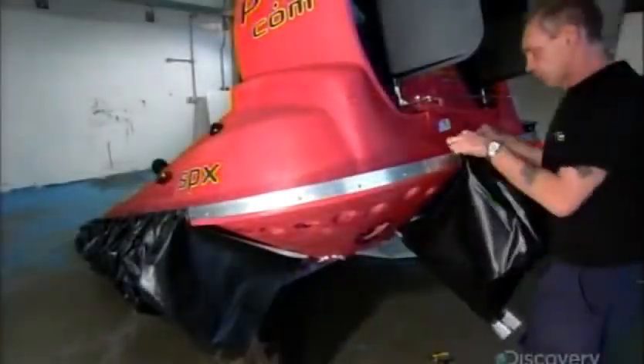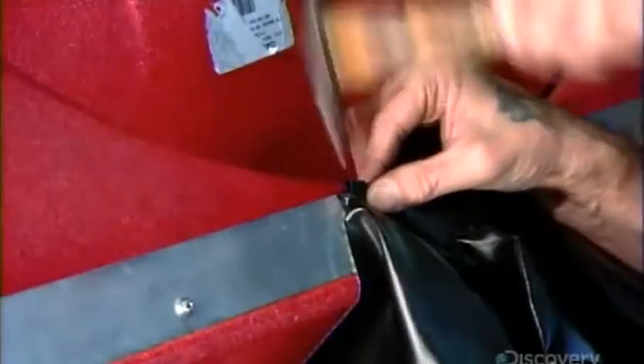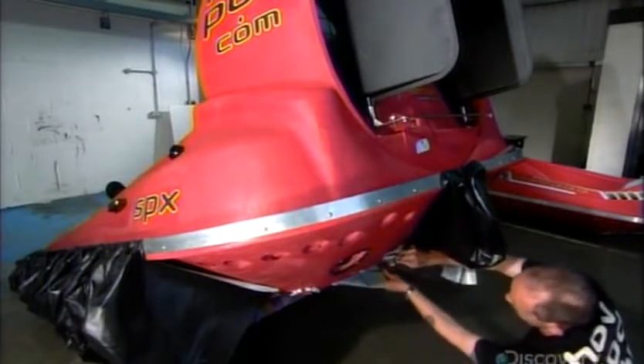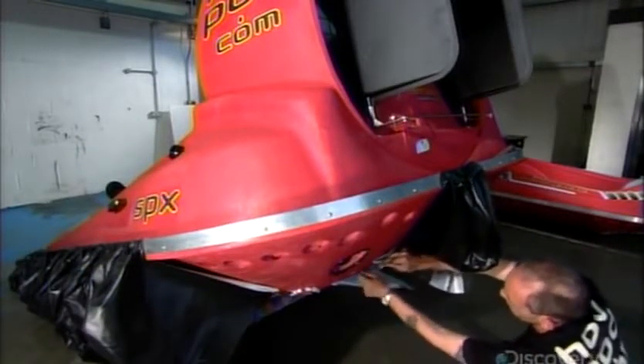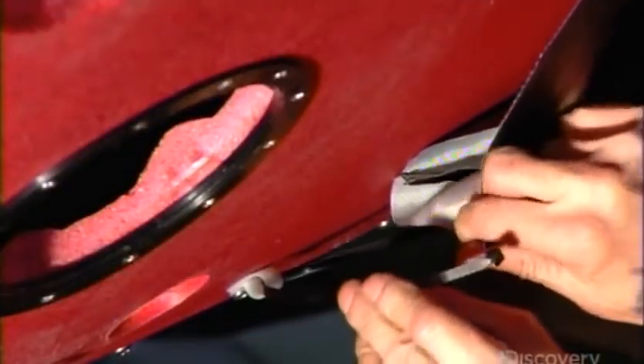The hovercraft skirt is made of the same material used on shoe soles, sturdy polyurethane nylon. They assemble the skirt to the hull in 65 different pieces. The worker loops each segment over a side bumper and secures it with a steel clip, then attaches the bottom of each skirt piece to the little hooks on the hull. He uses plastic cable ties for this job, and there's a good reason.